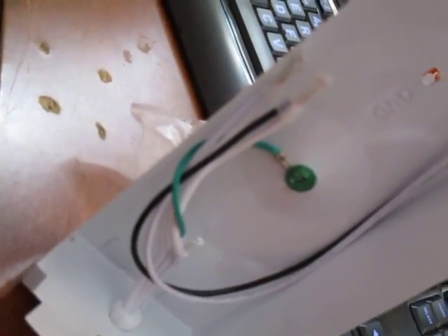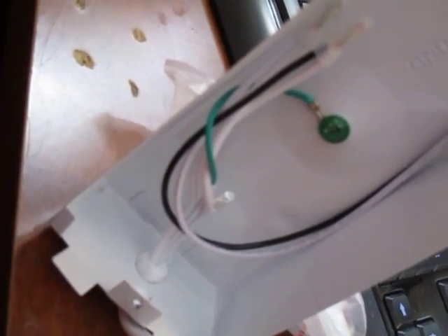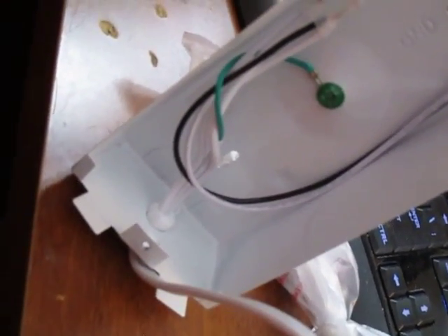Essentially, you're going to leave your ground attached to the metal — you always want to do that. The white wire is going to go to your neutral side of your holder, and the black wire is going to go to your hot side. Depending on the number of bulbs, you're going to have one, two, or four wires connected. It's as simple as that. When you remove the ballast, it's going to no longer run fluorescent lamps — but that's a good thing, and the fixture will also be a lot lighter too.